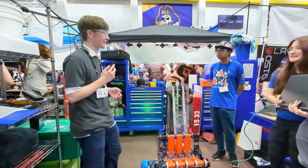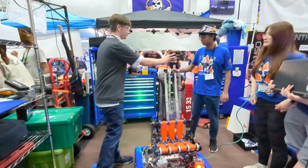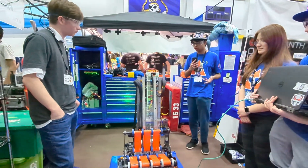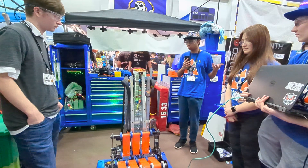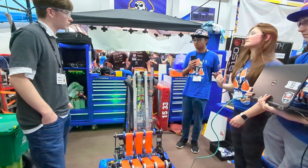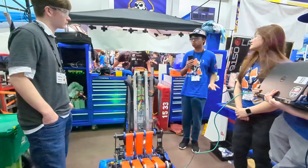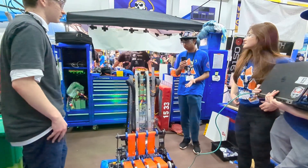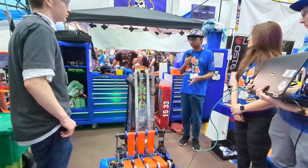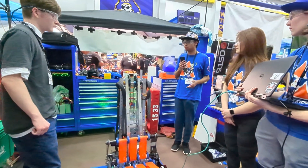It's really cool to see this. I'll pass this over to Kevil to talk more about what went into the programming and control side to control this awesome robot. So we use a Limelight to detect the AprilTags that are present on the field. In Asheville and Mecklenburg, when we were doing some testing to figure out how we can improve our cycle times, we found that it was hard to manually adjust the position of our robot, especially when the robot was far away from where the drivers were standing because there were other people in the way. So we decided to use the Limelight to help automatically align to the poles, and therefore allow us to improve the scoring process a lot.